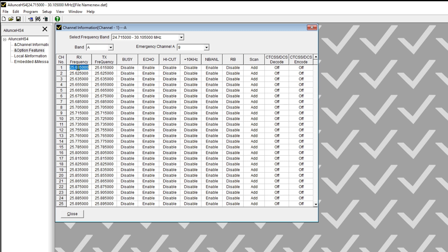If I look at this, I can type in a receive frequency and a transmit frequency. That's really handy for repeater work with offsets on the 10 meter band. Let's program in the 12 meter band — I'll enter 24.940 as a receive frequency, and then 24.940 as the transmit frequency as well. I won't mess with the high cut and echo settings — though I notice echo is enabled. I can also set CTCSS and DCS, which I'd use for repeaters on 10 meters. It's added to my scan bank — I'll leave that alone. Now I want to write this back to the radio, reboot it, and see if it actually works. I can do the same procedure through all the different bands to make any modifications as necessary.